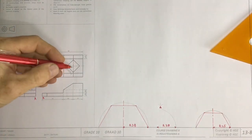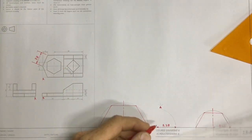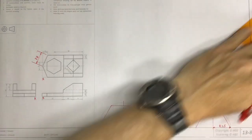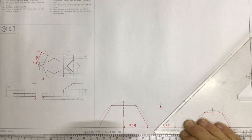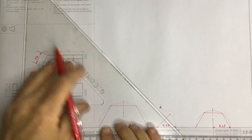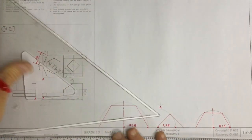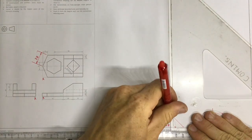The last one is that square. It has a side length of 28. I'm going to take a point from there, measure out, draw an arc of 28, take my 45-degree set square, and draw a line out at 45 degrees. That length is obviously 28 because of the radius, and I can now finish off my square by drawing that and drawing a center line over there.